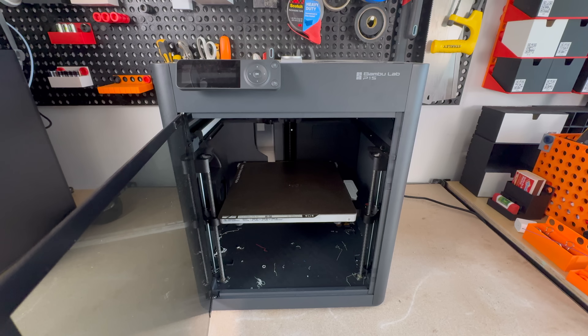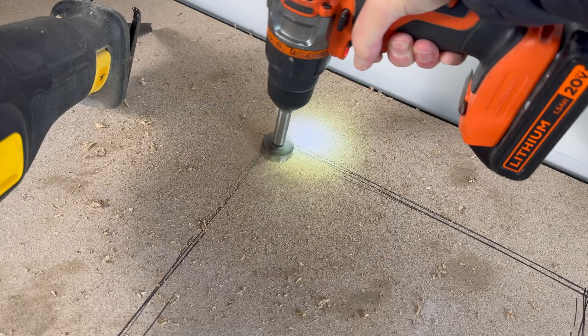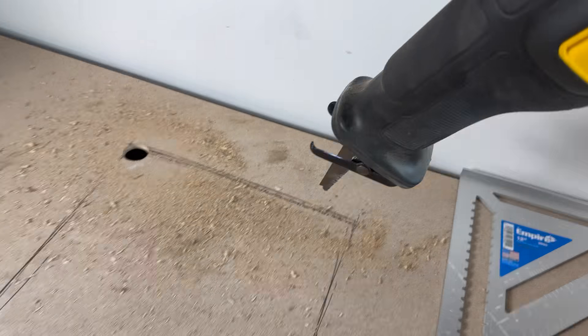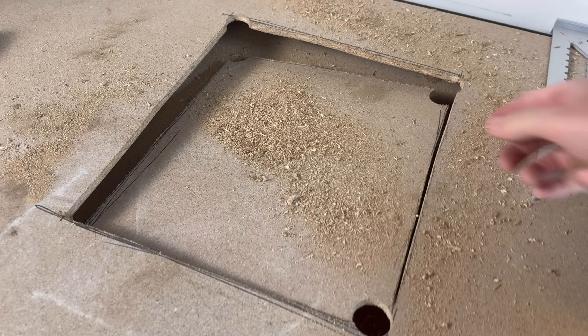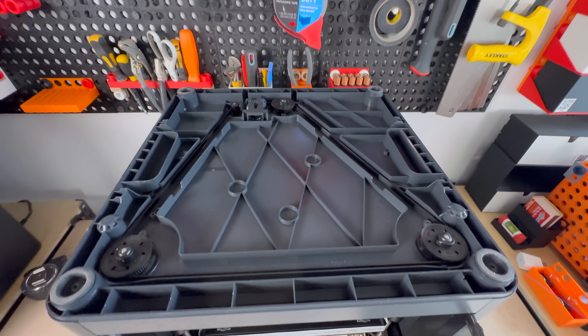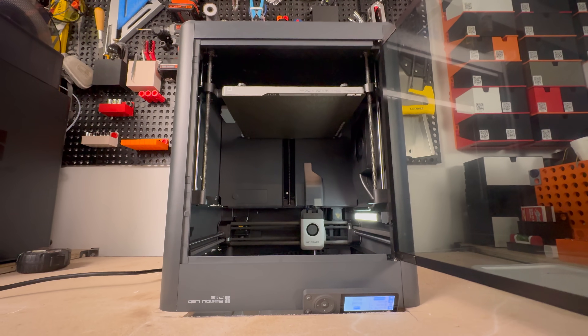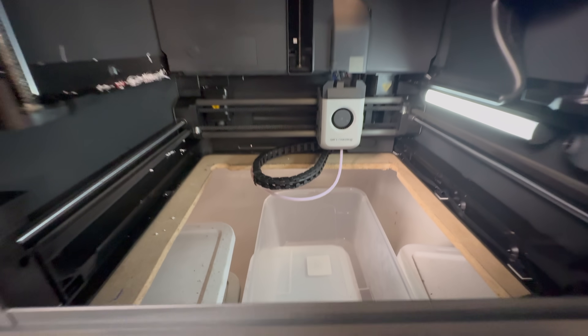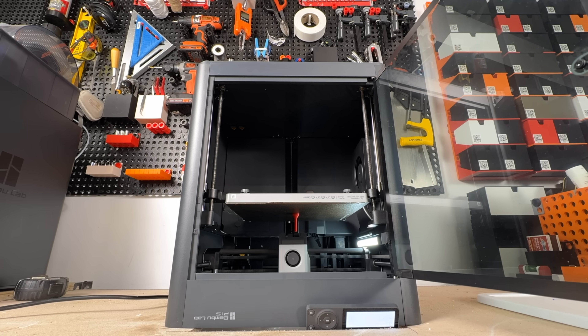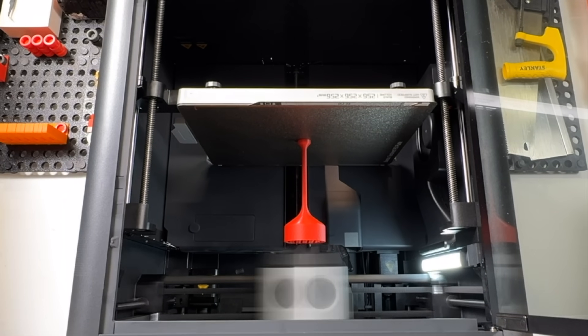Now let's move on to the last 1000 IQ 3D printing trick. We're going to start by cutting a rectangular shaped hole in my workbench — the size needs to be a little bit smaller than the size of the printer. This is where it gets ridiculous: take the printer and place it upside down over the hole. I know this is crazy and I actually don't recommend doing this, but it's kind of clever and it actually works. This is an automatic print fulfillment hack. Because the 3D printer is upside down, the print will self-release from the build plate and fall into the bin below. It even solves the purge problem. You always have to make sure the first layer is adhering well, and this is looking great. You also get the added benefit of being able to print really long and top-heavy objects. And when the print is done, it self-releases. How ridiculously cool is that?